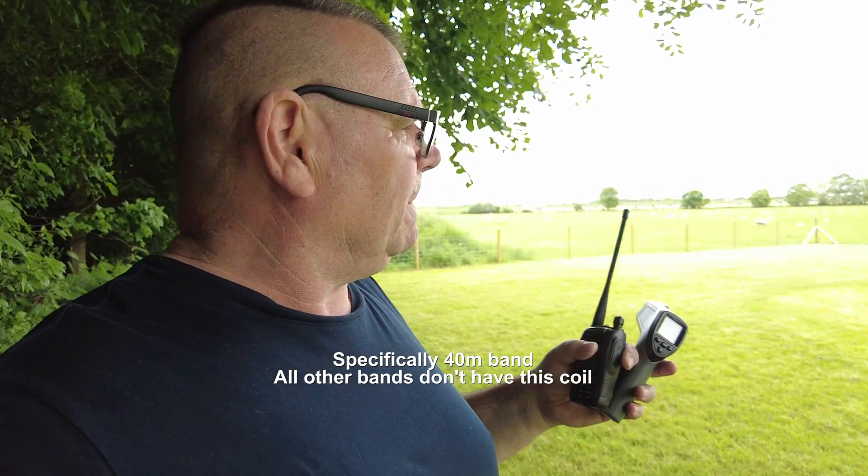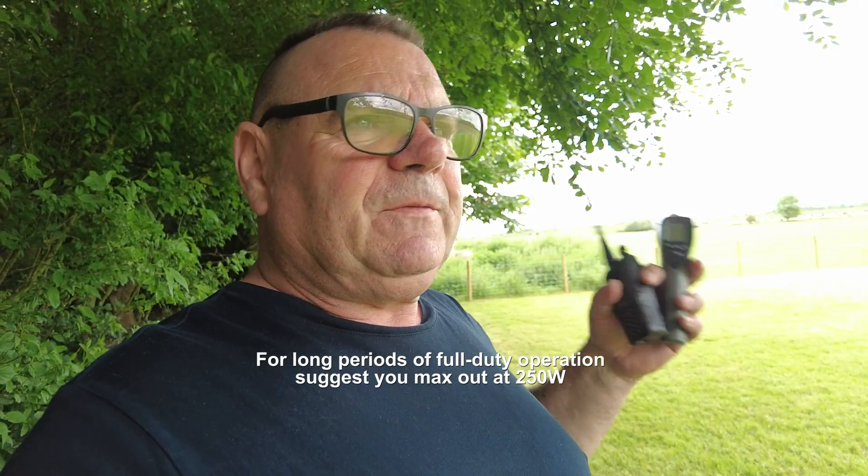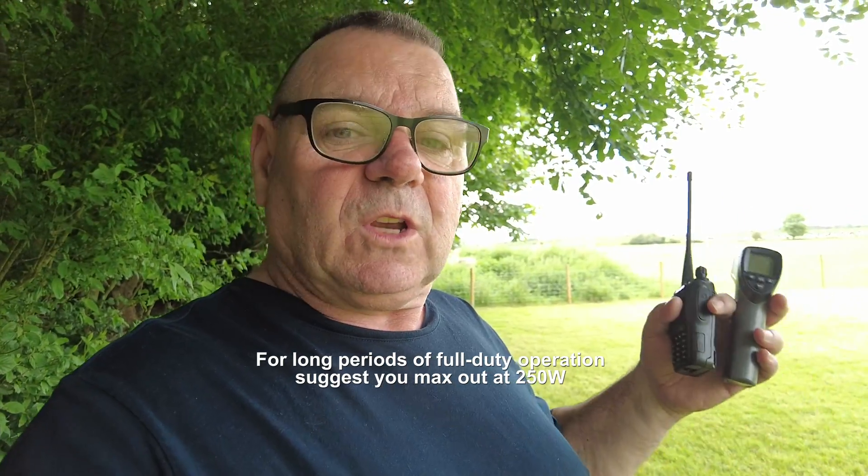It seemed to settle down at about 90 to 100 degrees centigrade and just stop there. So if that's key down, I reckon with a coil you're good for SSB — easily good for 1500 watts. You've got to remember though, as soon as you start doing high power SSB, other things start going wrong like your PL259s and your coax and everything. But good for 400 watts, 500 watts FT8 for instance, that would be fine. I just wouldn't do any more — it would just get too hot because it wouldn't have enough time to cool back down again. But 15 seconds on, 15 seconds off at 500 watts, I think you should be fine. But you've seen the test, make your own mind up.